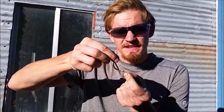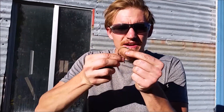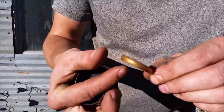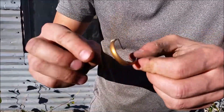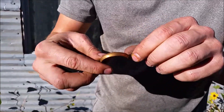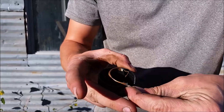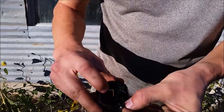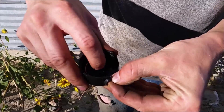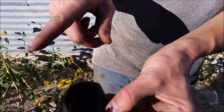You can see there's this little brass tube here with a little lever on it. How these work is this basically acts like a balloon. If you have a balloon that's curved or a piece of rubber that's curved and you inflate it, it's going to want to straighten out. Same thing happens here except this is a piece of brass. As this tries to straighten out as you put pressure behind it, it moves a little lever or even a gear which moves your dial.